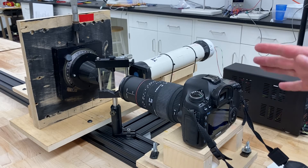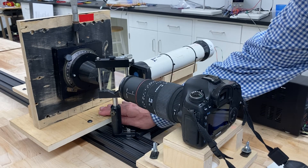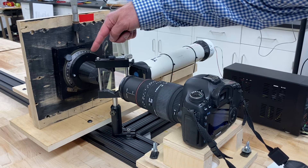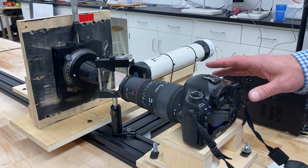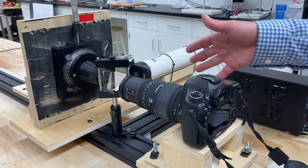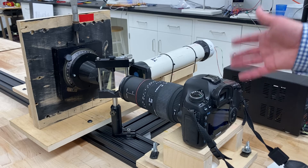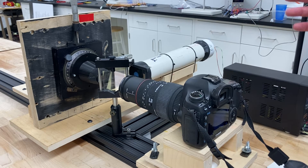This is the zero order right now, where the Wollaston is looking straight down the center, and we can move the Wollaston back and forth to either focus it or defocus it and see what happens. We're going to bring it a little bit closer, and when we do that, we can get one fringe to completely fill up the screen. Most people like that purple one, so we're going to keep it on that purple. So at this point, we can leave the room lights on, we can change the position of this Wollaston prism back and forth to see what happens with the fringes. We can also change the exposure on our camera, but with the room lights on, I will see a lot of lens flare and blown out images on the edges of the object from the scattered light from the room.